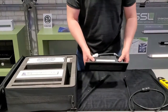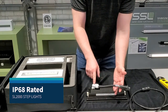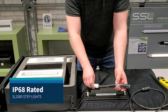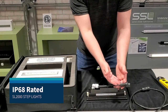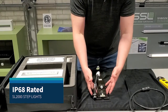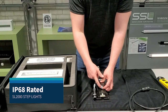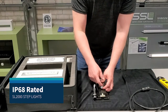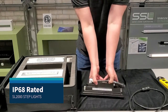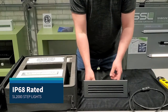All the fixtures have IP68-rated anti-siphon cabling with potting on the inside to prevent anti-wicking — so water moisture cannot get through into the wires in your fixture. This prevents all that from happening. It also allows the fixture to breathe underwater via this breather vent, which can allow air molecules in and out but not water molecules because they're larger. This really extends the life of your LEDs, gaskets, and electronics inside when you add breathability to a waterproof fixture.